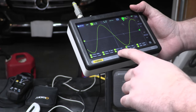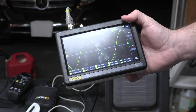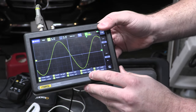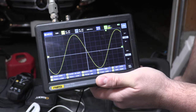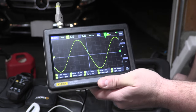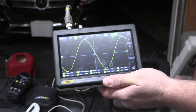We are looking at VRMS, right? So we're at 124 volts, so that is standard wall, it's going to be 120 plus or minus a few volts. We're well within. So let's hit it real quick and we'll see what happens. So I went to the, okay, so VRMS went down to like 90 volts or something. So we'll try to do that one more time. That's the high setting. So we drop down quite a bit, and duty cycle stays the same, and the 60 hertz frequency. And then one last one here. Oh, struggling.